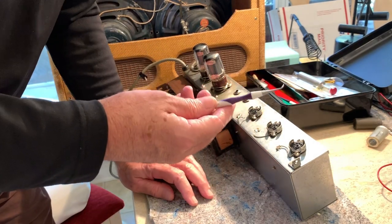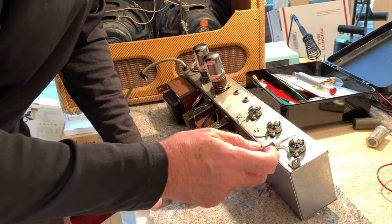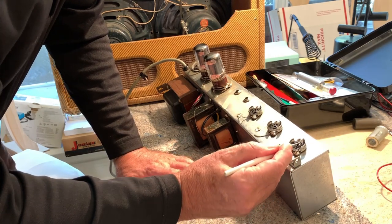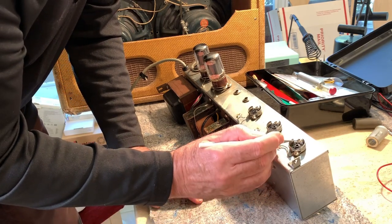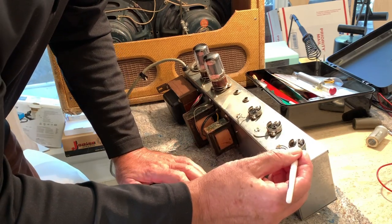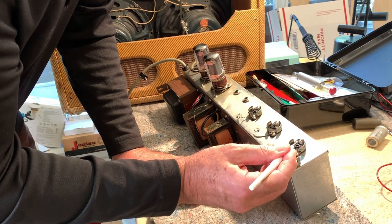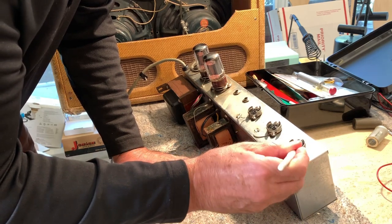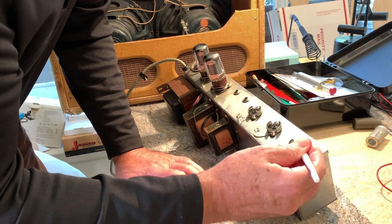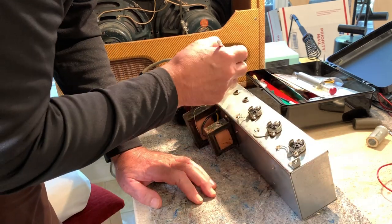So all I'm going to do is take this dental tool. You see that? Dental pick. I'm going to go down in the outer side of each contact and push it in just slightly. Like I said, they're so old that they don't really stay there for very long, but it might help. The DeoxIT will help. And there's only two halves on these things, so you just push on the outside of both sides and just go around and do all the pins here.